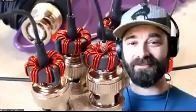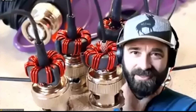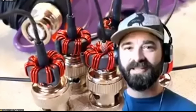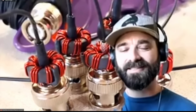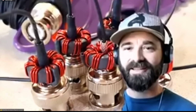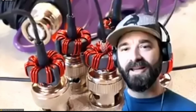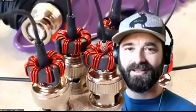Right. Well, let's talk about the antenna at home at first here. The home antenna is an 80-meter off-center fed dipole, and it gives me 80, 40, 20, 17, 12, 10, and 6 without a tuner, which is pretty sweet. It's been a decent performer. It's up probably 30, 35 feet at the center, hanging from a tree, and on poles at 27, 28 feet on the ends. The drawback, I would say, to that antenna is that I don't have 60, 30, and 15. And 15 can be an awesome band for DX when it opens up.